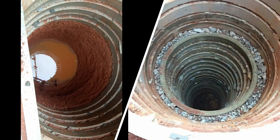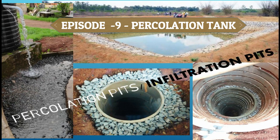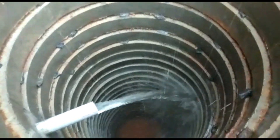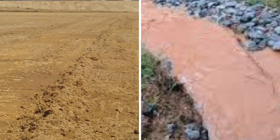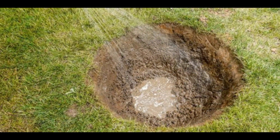Construction of a recharge pit or a percolation tank is explained in detail in episode number 9 of this channel. The depth and size of the percolation tank can be varied depending on the quantity of water and the nature of soil. Water from only paved surfaces — concrete roads and yards — should be led into these pits. Do not let water from natural muddy ground into these percolation tanks, as it leads to collection of silt and soil causing blockage.